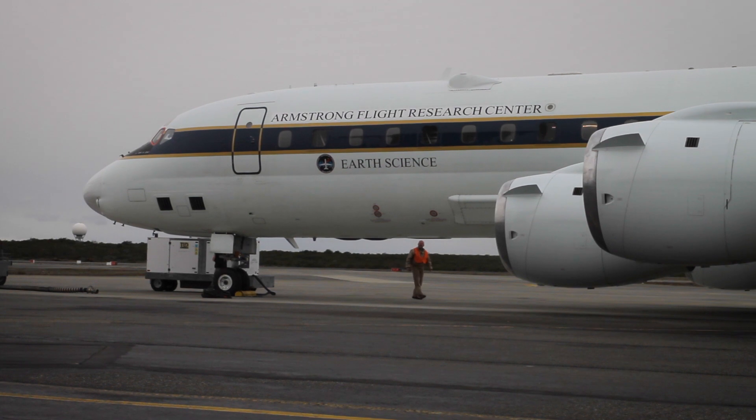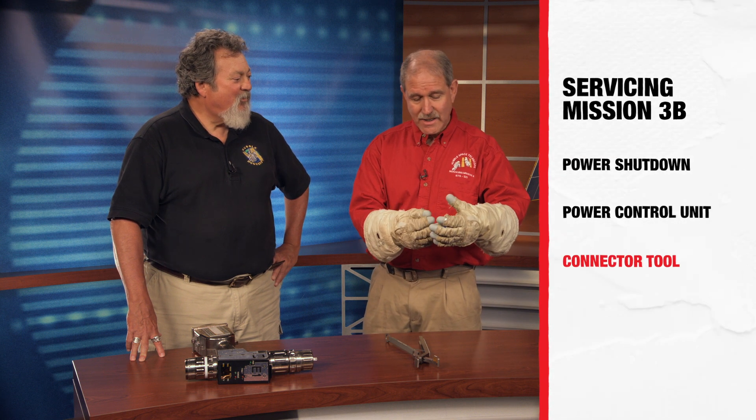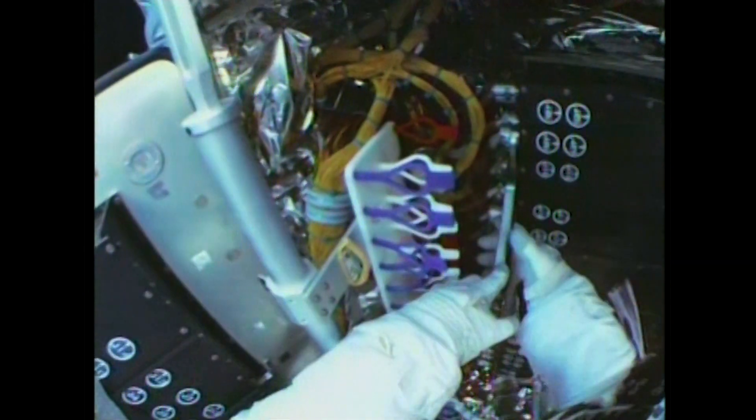We looked at what was available for doing avionics, for repairing airplanes. They had connector tools that were kind of like pliers. We tried those in training, but they just didn't have enough grip and were really hard to use because you had to do it two-handed. So we had to come up with a tool that would allow John to move and release those connectors while wearing spacesuit gloves. We came up with the high-torque PCU — power control unit — connector tool. It's really simple, and it's actually my favorite Hubble tool: one, because it worked great, and two, because it's very simple.